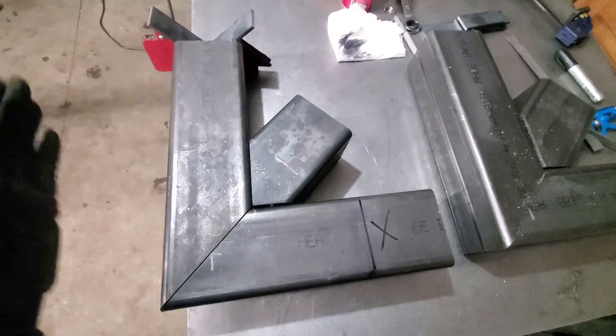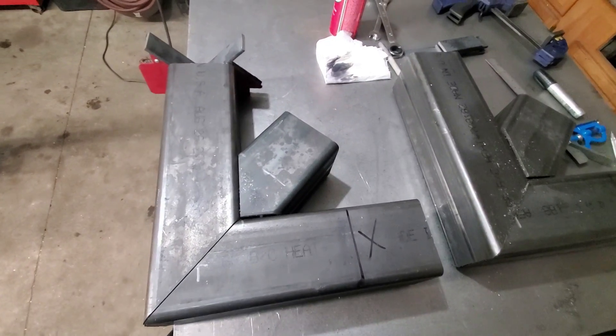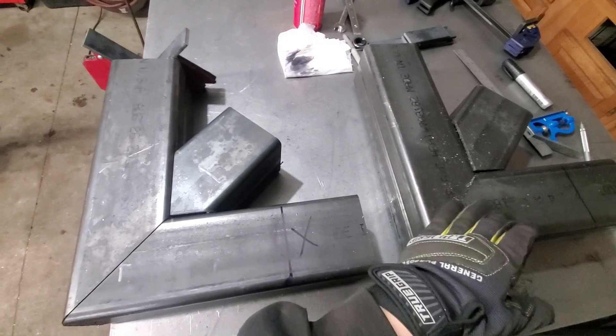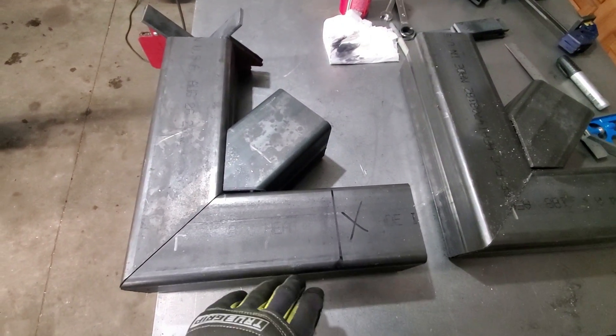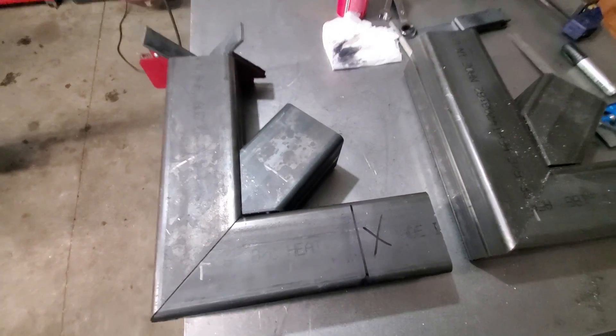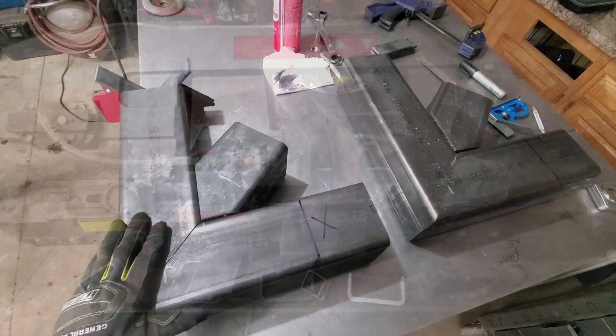So I decided to put this compound miter on here so the tube sits down lower and your kindling feeds more into the zone where your fire is going to be. I didn't have that much of a plan when I started — just rough overall dimensions — so I'm pretty happy with where it is now. I'm going to trim this off on both of these, then move on to cutting pieces for the base, just a little riser base so it isn't sitting on the ground.